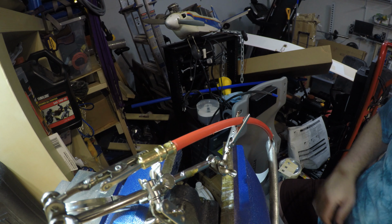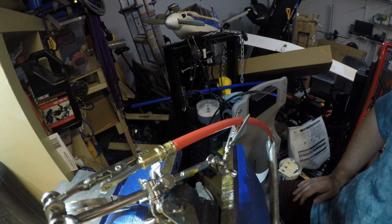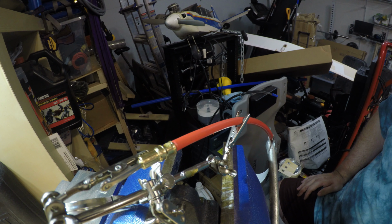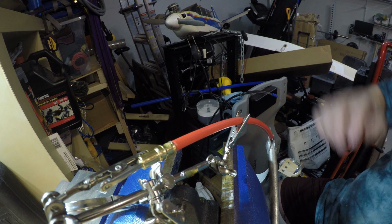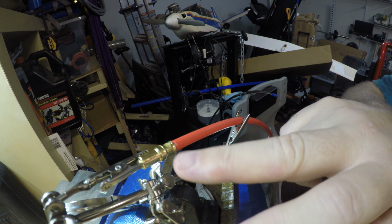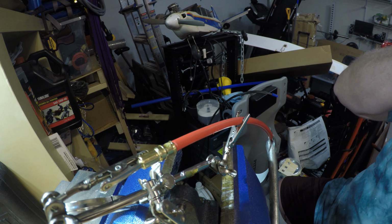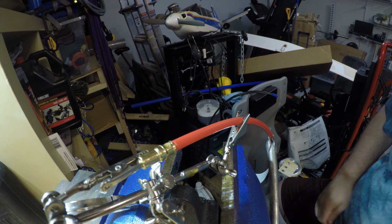Okay, we're back here for the second cable. The cable was already tinned and inserted into the ferrule. A little bit of flux in the ferrule, a little bit of the rosin flux paste on the tip, and I'm holding it with alligator clips on each side. The alligator clips also do a great job working as a heat sink to remove the heat buildup, so the insulation never really even gets to the point of melting. Most of the heat is sucked over there to the left and dissipated.